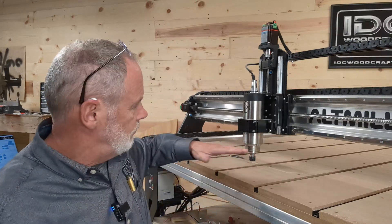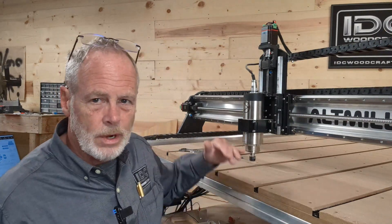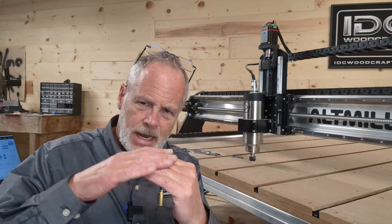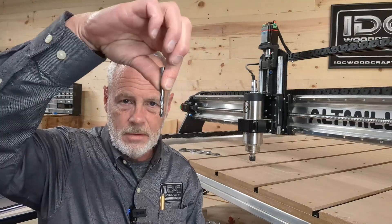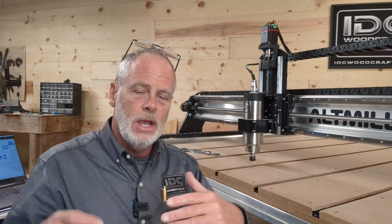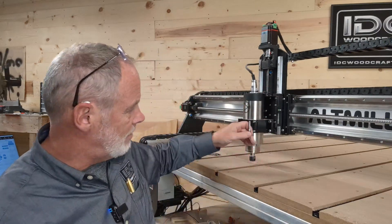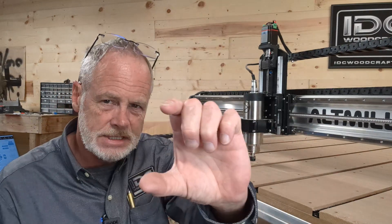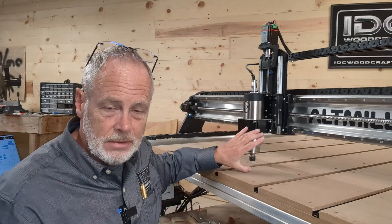To rehash quickly: first check your max travel — the physical limits between the carriage and the spoil board. Then move the spindle up as far as you can and give yourself plenty of clearance between that physical limit and the end of the spindle, trying to get about an inch where it's still above the physical limit. Then take the bit out and move the spindle down as far as you can. If when it's all the way up you've maximized clearance with the Z carriage, but when you bring it down there's a lot of space left at the bottom, it's better to bring the spindle down in your adjustment.